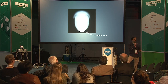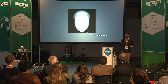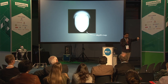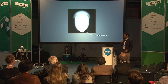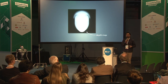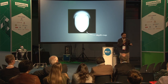So the light sensor doesn't just read black and white. It can read the full range of the grayscale. So I decided to print an image like that, put a sensor to read each part of it, and send the drill deeper or higher. The problem is that my first prototype didn't work with that. It was terrible because the light sensor doesn't read just a pixel. It's going to read an area. So it's going to take an average of it. So the result didn't work.